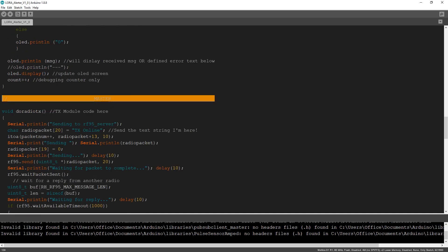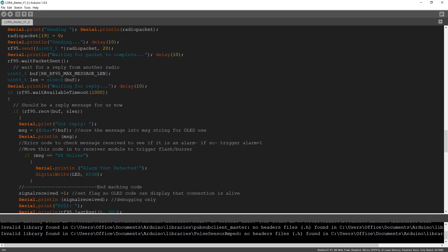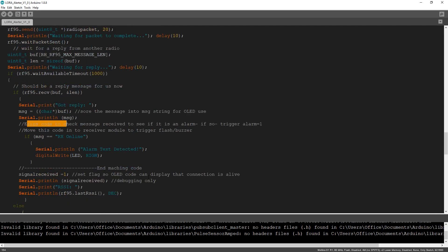Here's the master code - we do radio TX. This is the TX module or master module, so this is only called if we're doing radio transmit. A bunch of nifty little radio stuff - this is going to define TX online and send the string that I'm here, so this is actually sending this string out so that the other radio hears it and knows it's alive. Waiting for packet to complete. I added some notes here for the alarm functionality - basically this was designed so that if I had an event, I would measure an input and then send back to the other radio that that input was there.